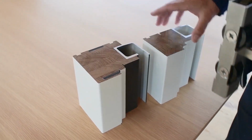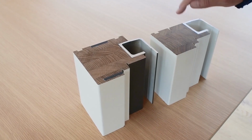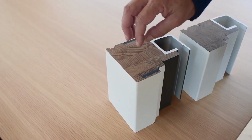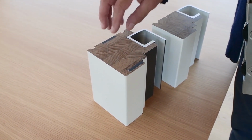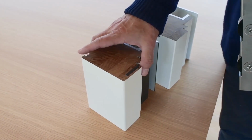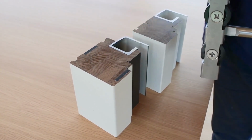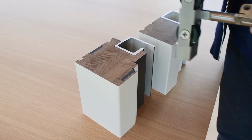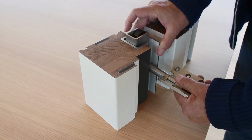This top frame is a bit taller, about 2 centimeters, and is reinforced with carbon fiber. This allows for folding doors with a width of around 3 meters to be self-supporting. The top frame needs to be screwed into a house element to resist blowing winds. This top frame does, however, bear the panels and remains straight level.